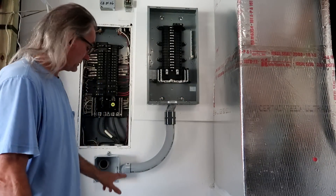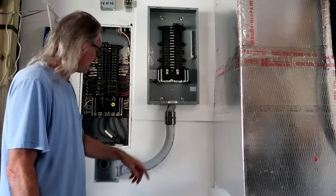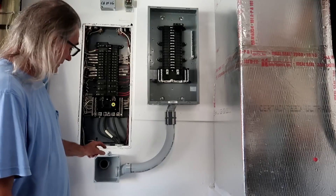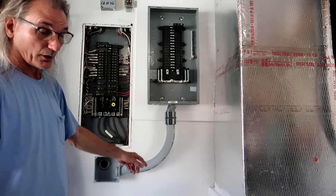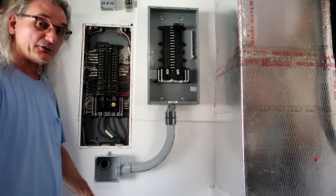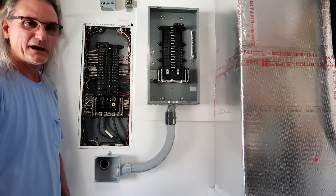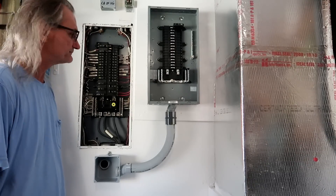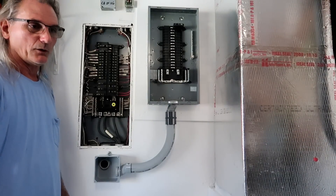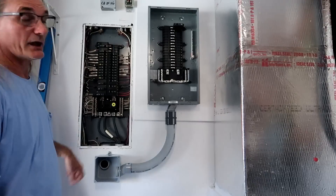The sub panel is on the wall, the conduit is glued into the fittings, and the offset nipples are in the box. I'll take the box and conduit apart, string all the wires through while everything is laying on the floor to get the wires through each panel, then put it all back together with the wires already in the conduit. That way I'm not pulling any wire through the conduit — it should go together easily without abrading the outer coating and insulation. I opted for 3-gauge copper instead of 2-gauge aluminum because the copper gauge is smaller and easier to work with.